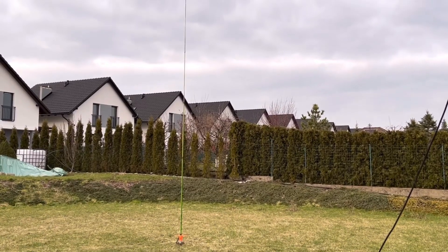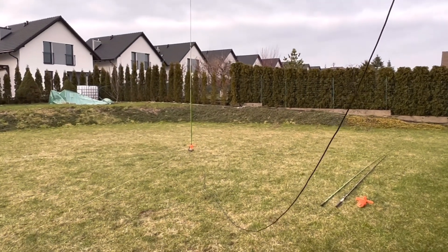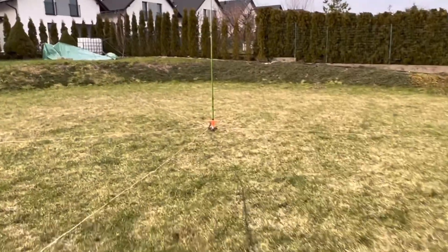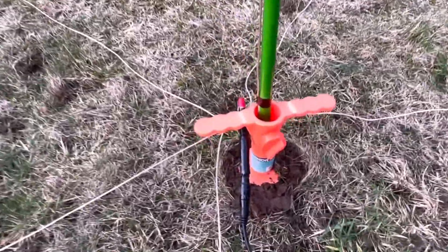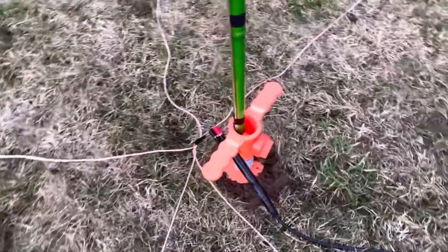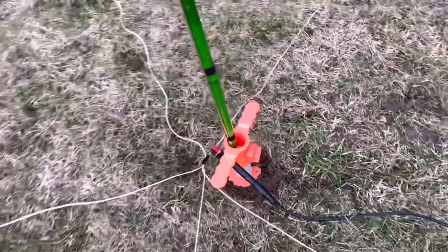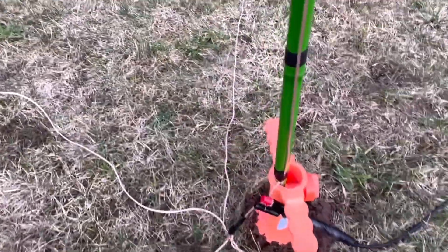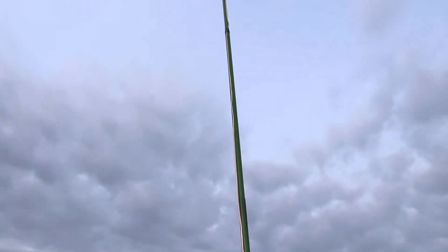Now let's move over to vertical antennas. The match to the dipole as a monoband antenna is the quarter-wave ground plane. You can build these monoband for different bands. I've had great success building them for 20, 15, and 10 meters. I did a video called 'Dirt Cheap DX' where I build mine with just an inexpensive pole and 16-gauge speaker wire. These require a ground plane. A common question is how long to cut the radial wires — they don't have to be resonant if they're laying on the ground. I usually cut mine around 5 meters, and for portable ops, 4 to 6 counterpoise wires on the ground works well.